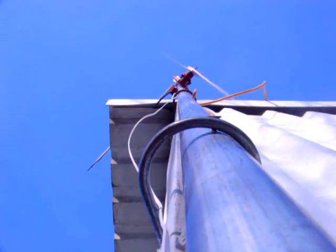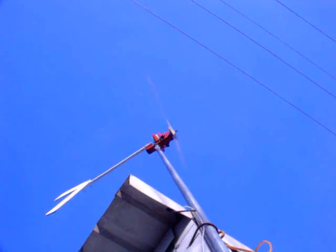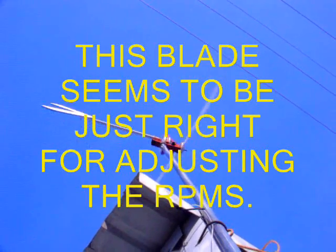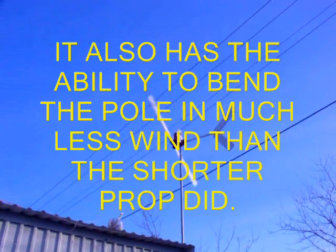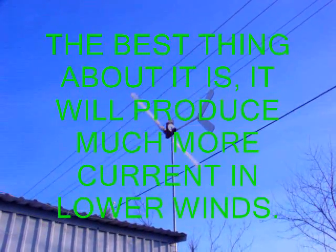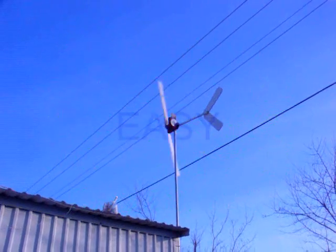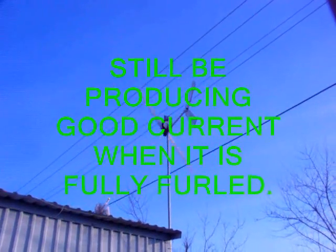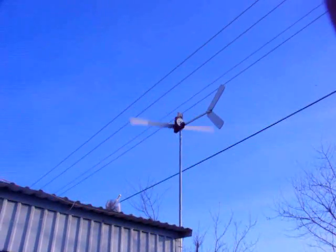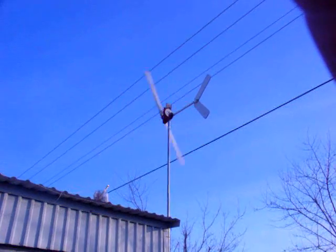Hello, I'm Scott Brown. Looks like we got it pretty straight — I used ratchet straps. The wind is cruising along nice and slow with the 73 and 3/4 inch blade, which slowed the RPMs down. We were getting charging voltage one-third quicker than we should have on the old blade. Haven't had very high wind today — seen it get up around 25 mph and saw about 10 amps come out. It's balancing real nice — one side of the blade was a little light and the Flex Seal is pretty heavy and thick, so I painted the light side and it worked out. A lot quieter, a lot smoother, starts up easy, charging voltage is spot-on.